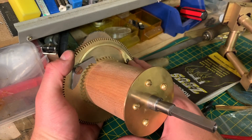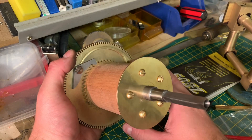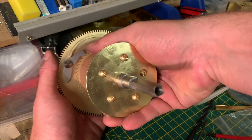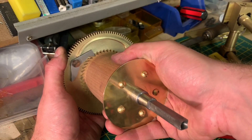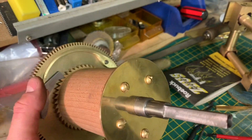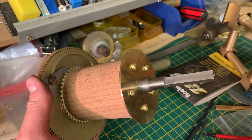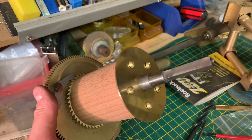It's got late, I've put everything together, and this is going to be the end of the video. I've got the click, the click screw, and the spring in place. The spring definitely needs polishing up and finishing, but it works - you can see you're going to get a nice click back down on that spring, and the click fits nicely. Bearing in mind the weight will be driving it in the anti-clockwise direction, it will click and then immediately lock back in place on the new gear tooth. Really pleased with that. Next step is hopefully mounting some of these parts on the actual frame itself. Thanks for watching - hopefully get another video out soon, I'll keep going with this towards Christmas, cheers.